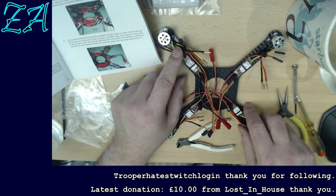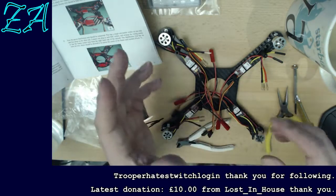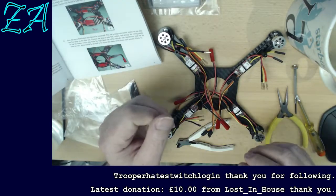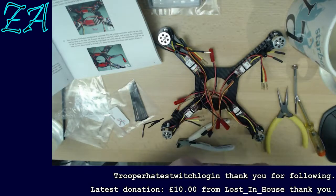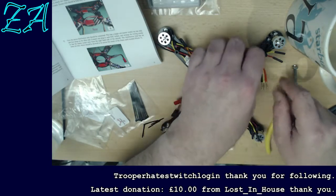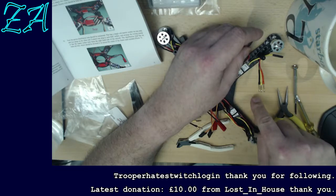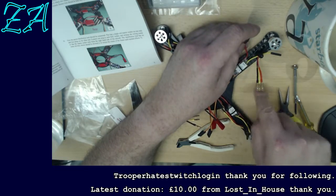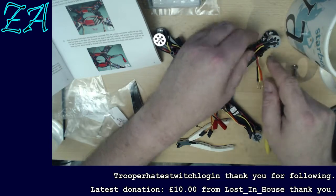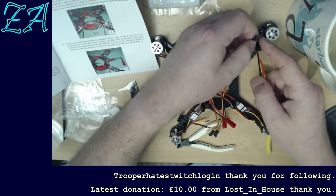Invariably it comes back, which two? It's any two, but they need to know what colours to swap, and it doesn't matter. It's just weird. Forum threads and discussions will go on for about 10 replies with people going, but how do I know which colours to swap? That's the fun thing. If you were to plot out on a graph the way the signals are sent down these wires, it becomes possible to see why reversing any two of them works, but apart from that, it's a really hard thing to describe. To get into technicalities, it's all about phase relationships, but I'm not going to get into technicalities.